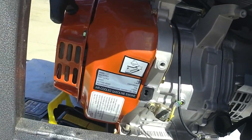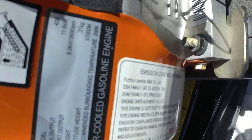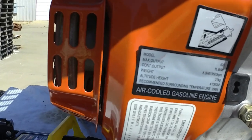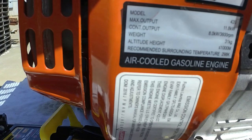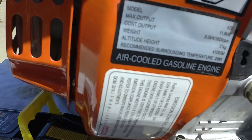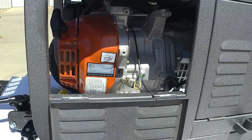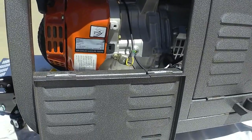Also right here you see you got a little ID tag with some info — you've got emissions control information down there. It'll have the brand of the unit usually on that sticker. A lot of these units have that sticker somewhere on the blower housing with this information on it. If you're ever curious, just give us a call up front and we'll be glad to help you out any way we possibly can. As far as changing your oil, they take 10w30 — they recommend a synthetic blend. Any questions, give us a call. Hopefully this helped you out.